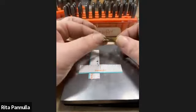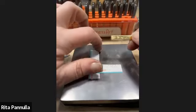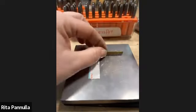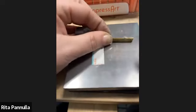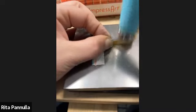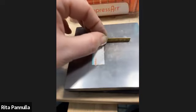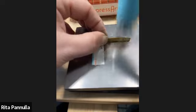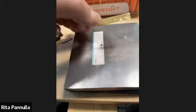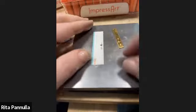Now, again, like we said, when we're forging to metal, we get that little bump right there. And that's only because when you're forging into metal, it spreads. It's got no place to go. All right, so I'm gonna take my blank. I'm gonna give it a couple of nice taps. I'm not being too aggressive. I know it's hard to see the force that I'm using while on a Zoom call, but it might sound worse than it does. It's basically a very light tap, and you can see it brings your metal right back to where you came from.